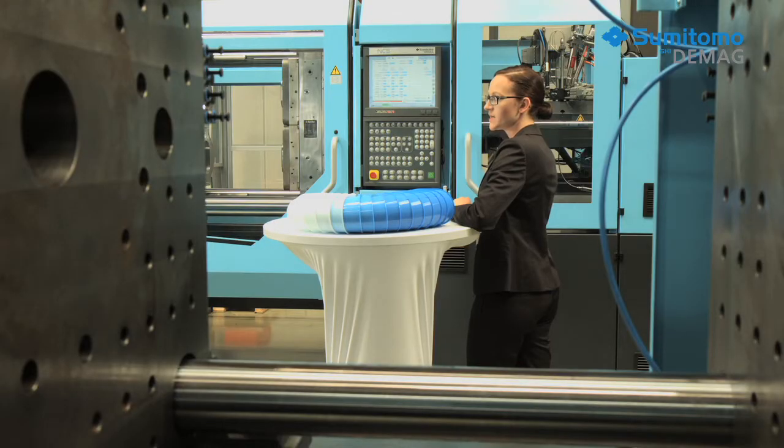The conventional approach of direct pigmentation has one drawback. As the added pigments contaminate the entire plasticizing unit, color changes often take a long time. The machine must be cleaned and purged with the newly colored material. Moreover, the metering system must be loaded with the next color.